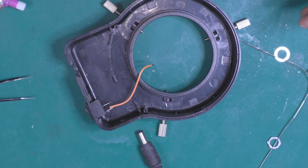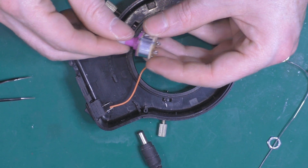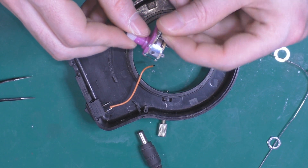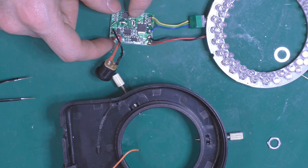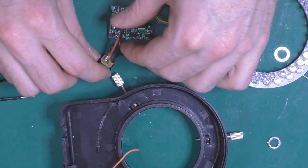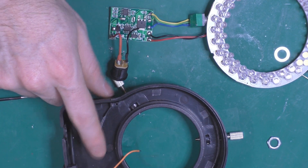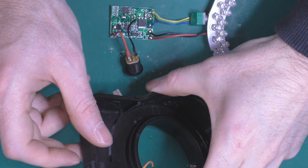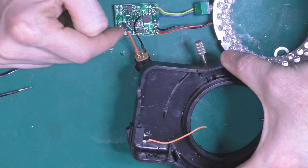Changing the plan. I don't understand because this is a two-pole switch, really separate, and a classic potentiometer. The trace here doesn't go anywhere so I don't get it. I'm going to change that — I'll link the ground plane to the power switch here, and connect this to the ground plane. So when I close it I'll have a closed circuit, and then I open the ground.